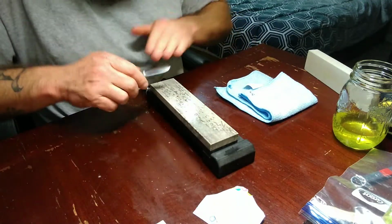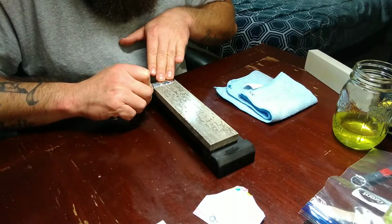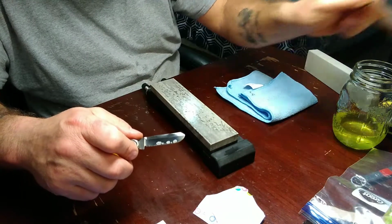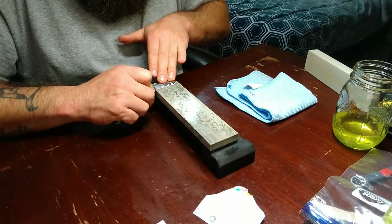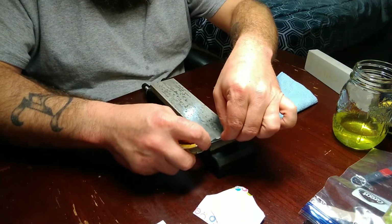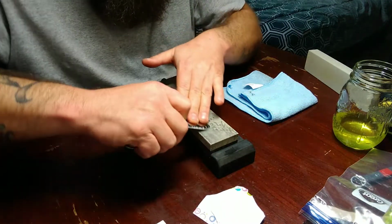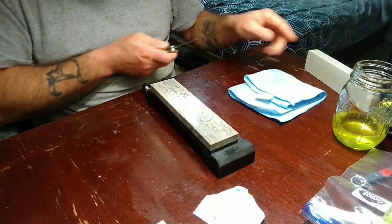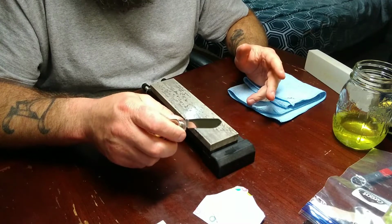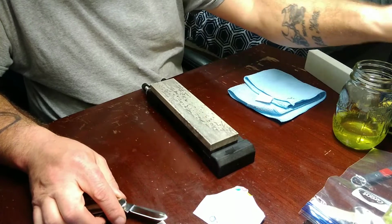But anyway, I had a black the other night that was lapped straight from Dan's. I hadn't used it yet, and I was like, I'll just throw this knife on here and touch it up. It was this one right here. You guys have seen that one on that channel. That's what I carry a lot of the time. That's a Great Eastern Possum. And it didn't really do anything for it. I was like, whoa, well, that's weird. What the heck? It was dull, but it wasn't just crazy dull. And I started getting a little bit of a burr off that stone. And I noticed it was cutting metal really quick when I wiped the stone off. And I was like, man, that's weird for a black. And then I went from that black to another one of my blacks that has been completely lapped, probably like 2,000 or 2,500 grit. And the edge that I got was just wow.